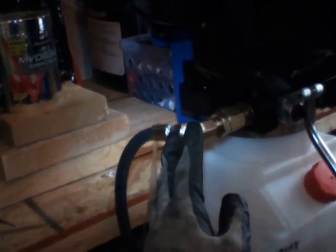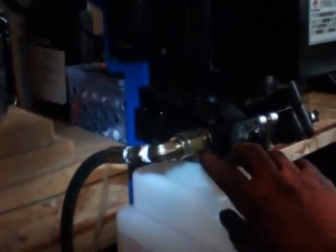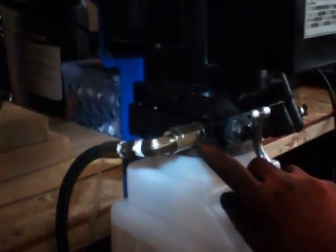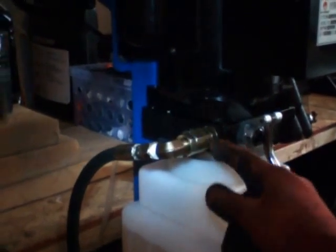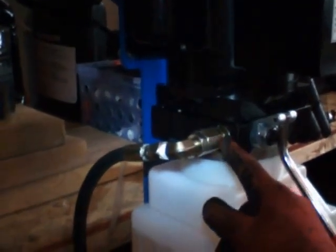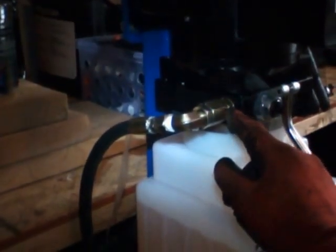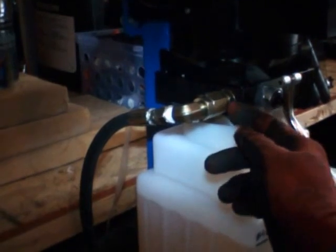And the second issue was right here on this bolt that connects into the power unit. If you read the setup instructions, it says not to put too much pressure when you're torquing this into the unit, and that's exactly what I did. What happens is that I ended up bending the ring, and so hydraulic fluid was finding a way through that little hole to come out.